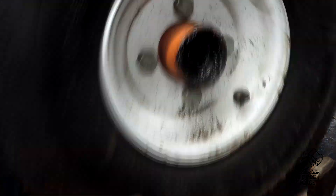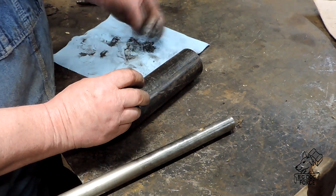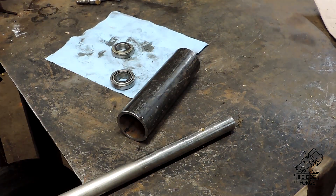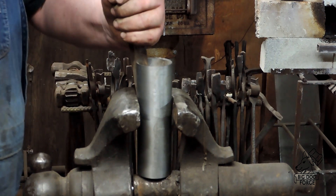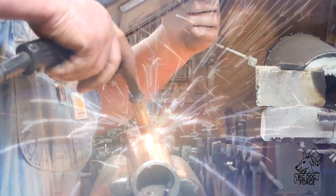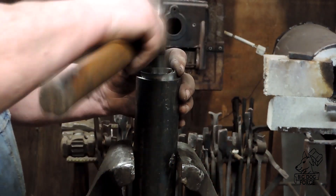We're going to get rid of these pillow block bearings. We've got our other wheel and we've taken the bearings out of it. We've got another piece of pipe and we're going to put another separator in there to keep those bearings apart, then press them into place. We split another piece of that axle down the center and drove it apart to make it a little bigger because it didn't fit quite snugly enough. Now it fits good and snug — we'll weld it in place once we get it centered, then took it over to the lathe and cleaned up the ends. We'll get our new races in there.